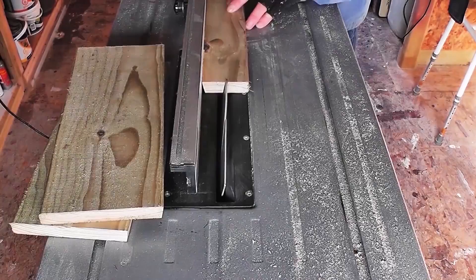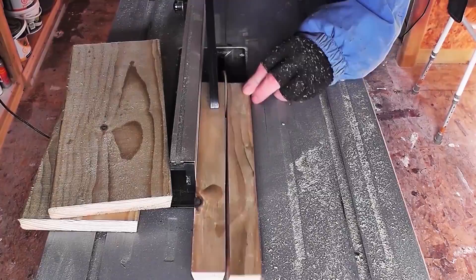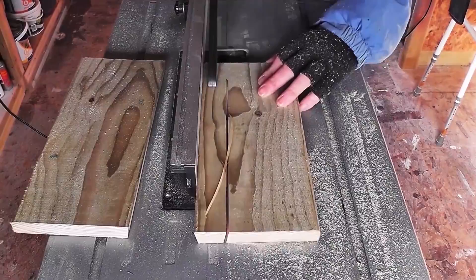The most difficult part of this build is the roof. So before anything else we have to cut 10 pieces of timber with both edges ripped to 10 degrees. This is to enable us to build a three-quarters circle. As you know, the old gypsy caravans had a really round roof.